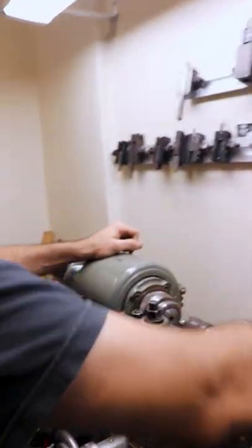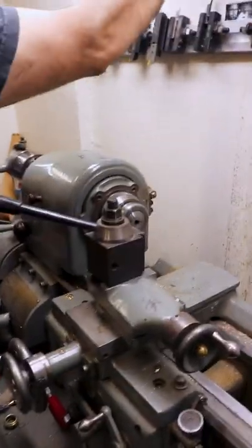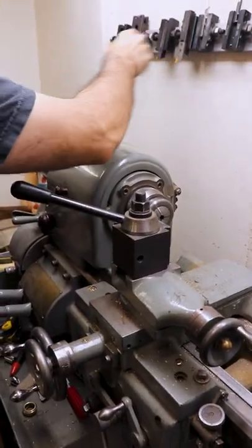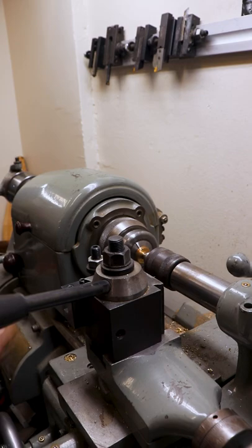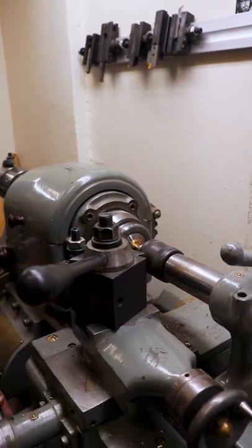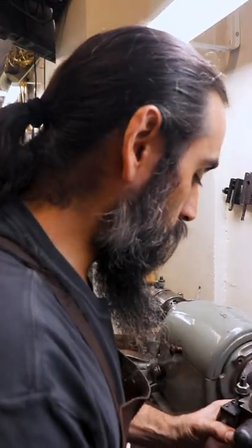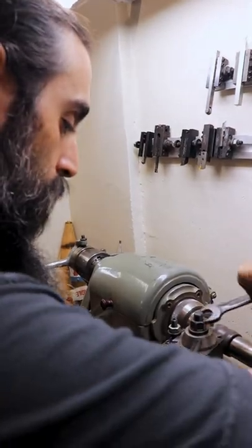The last setup was at 90 degrees. This setup, because we're going for a very small hairline — we're talking thousandths of an inch — we set up a quick-change at an angle so that the face of our tool can reach under the lip and it won't affect our bearing fit.